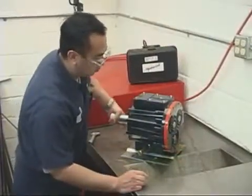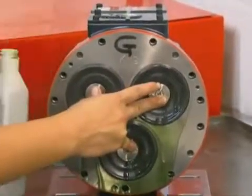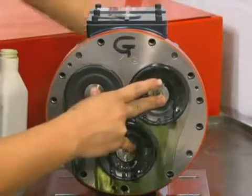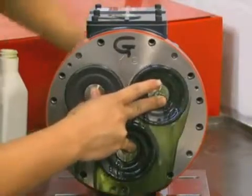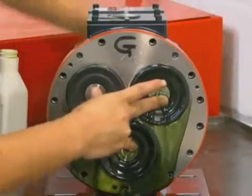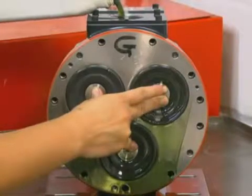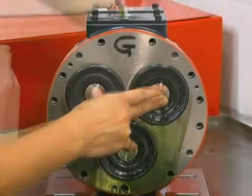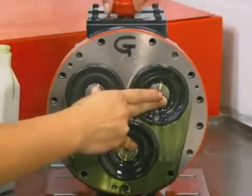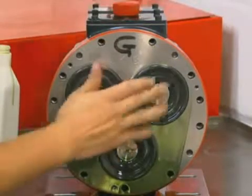A shaft rotator is included in the hydrocell tool kit. Push on the diaphragm screws to keep pressure on the diaphragms while turning the shaft. Continue to check the oil level in the hydraulic end of the pump while turning the shaft, maintaining the oil level above the holes in the reservoir. Continue turning the shaft and checking the oil level until there is a bubble-free flow of oil coming out from behind the diaphragms. The hydraulic cells are now primed. Replace the oil fill cap, then wipe excess oil from around the pump head.